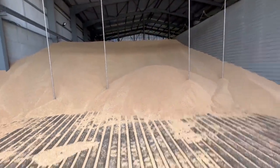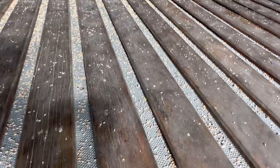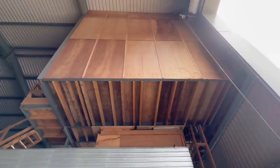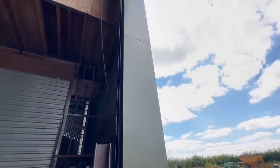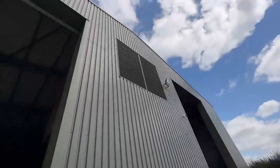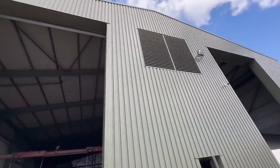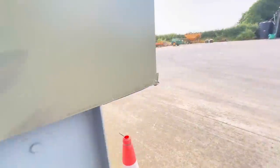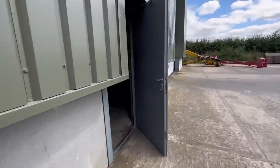This shed was built in 2011 and this stirrer beam was £16,000 — that included all the tracking and everything. Today they'll be double that. There are two or three different makes; this is what they call a Record. It works well — stirs the heap up, freshens it up, and gets the airflow going through the floor. The fans are up there pulling air in from outside, and the fans push it down into the tunnel.